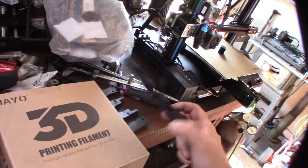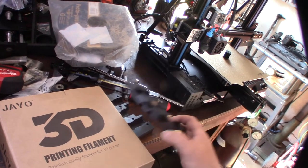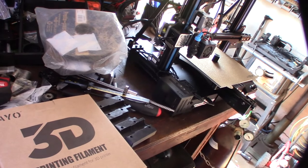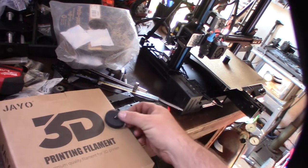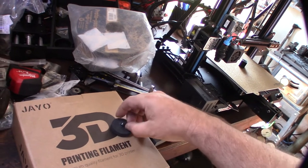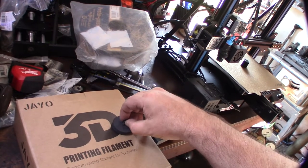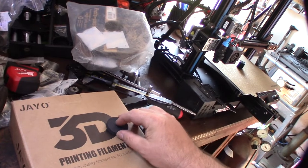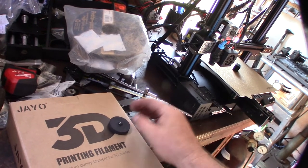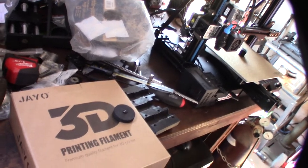I had to do some CNC parts and I printed them at 100% infill — weight is not an issue but I'm actually looking more for strength. With my past experience with carbon fiber PLA, you need a hardened steel nozzle, so I already have one of those. It was pretty expensive, like $25 for the nozzle.